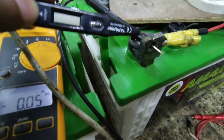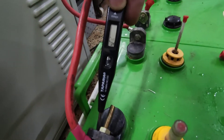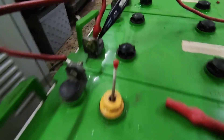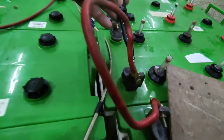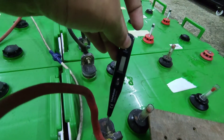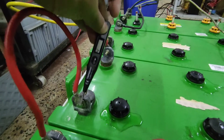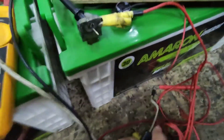Now let's measure across individual batteries. At the full 120 volts — nothing. At just 12 volts it is showing something, at least something like 12. If I touch on the next point it should be 24 volts but it's showing 12. At the next point it sometimes shows nothing at all — its behavior is completely random when it comes to DC. At a point that should be around the 36-volt region it was still only showing 12 volts.